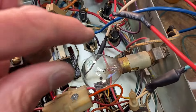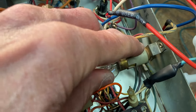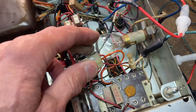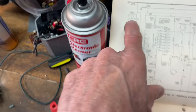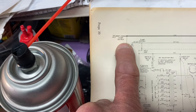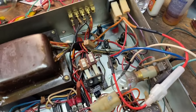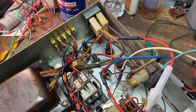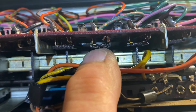Also look at your current limiting bulb — this connection was okay but it was loose, so check continuity across it; it should be around 2 ohms, matching the filament of the current limiting bulb. I did all this, and what it turned out to be was another bad fuse — this fuse had blown and I didn't like its holder either. It's hard to visualize, but here's the bad boy type of thing you're looking for: a bent contact up on the keyboard, not making good contact. Here's what they're supposed to look like — nice and narrow.